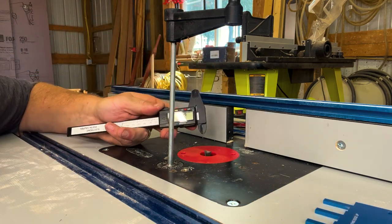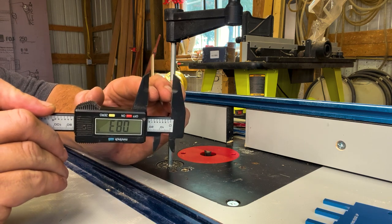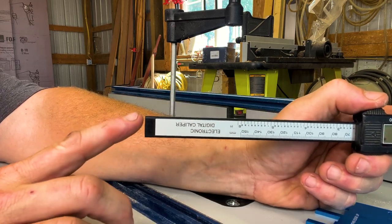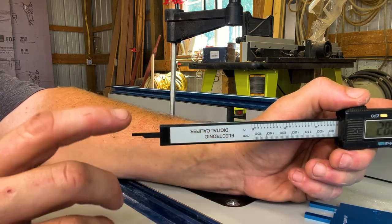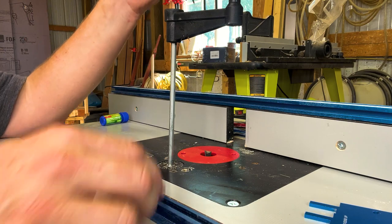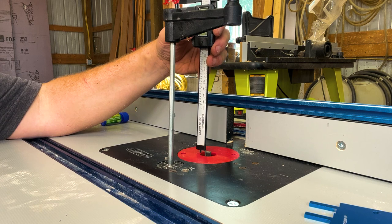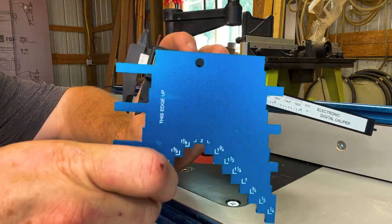What I should have bought — and eventually did buy — is a nice set of calipers. Most beginning woodworkers know that calipers tell you how thick something is by placing it between the two claws. But there's another feature most beginners don't know: there's a depth gauge at the very end. As you open the claws, a little tab sticks out and tells you the depth from the tip to the end of the rule. By referencing the end of the ruler, which is made of plastic, I can push down and touch the table and see I'm right at one eighth of an inch. For the beginning woodworker, a set of calipers means you have no need for a depth gauge whatsoever.